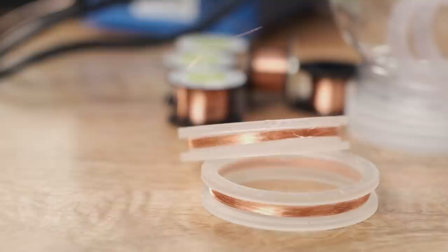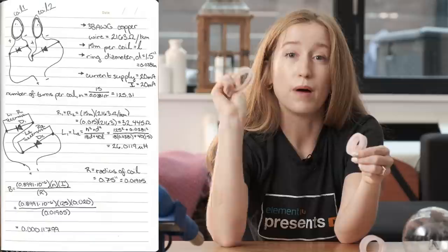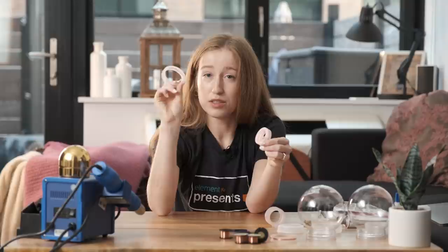So I've got my first pass at these rings here, and you can see the idea of wrapping the copper wire around. Based upon my calculations I thought this magnetic field would be strong enough, but after wrapping it up and testing it, the rings were too big compared to the gauge of my magnet wire for there to be any recognizable magnetic field. I'll pop that equation and my calculations up on the screen. So after my first test, I made my rings smaller and reprinted them, and based on those calculations we should get a much more recognizable magnetic field.